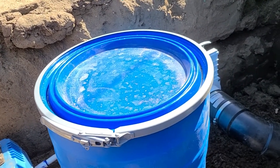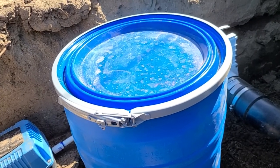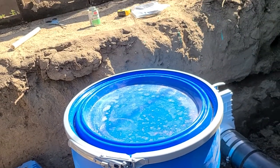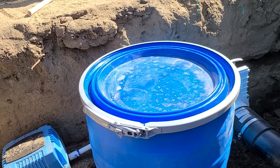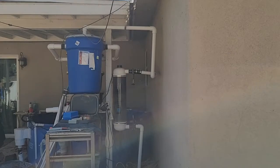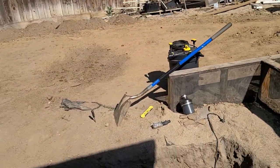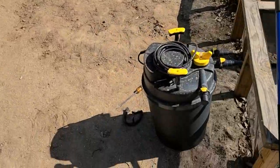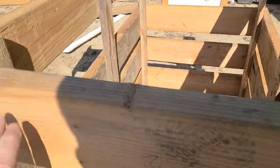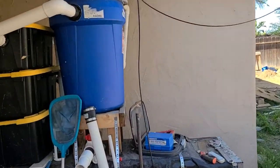I'm gonna come out of there with two sump pumps — I already have them, I think they're like 2,000 gallons per hour or something like that. They're actually in use in my other pond where the fish are at the moment. I'm gonna pump half of it into my Tempest over here, and the other half is gonna go into this pressure filter, and then the pressure filter is gonna come out into this gravel filter. The Tempest is basically gonna repeat this same filtration system right here.